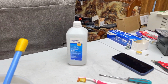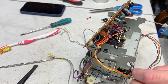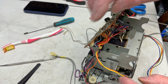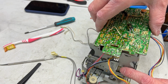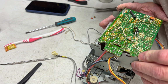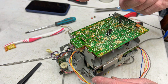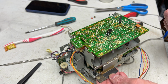So it is time for me to access the Capstan motor so I can get that part of the recap done. So should be fairly close to being the same as the DD-99 here, but there's a couple of wires that run down to the counter board that might trip us up a little bit there. So I don't know how easy or hard this is going to be in comparison, but it should be fairly similar, I think. I believe this whole plate will just fold up out of the way. Not sure, but I think that's the way it goes.